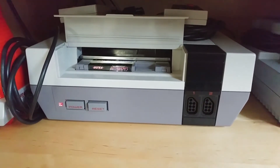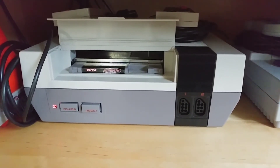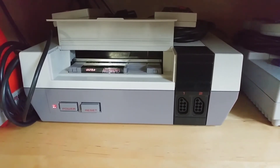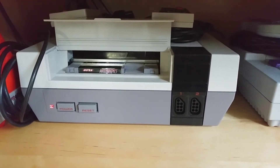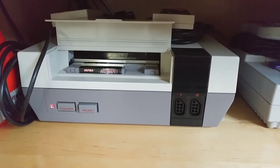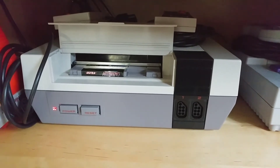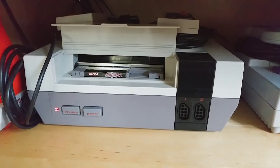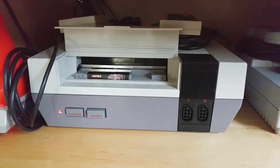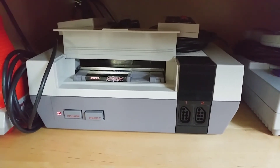The moral of this story is: clean your NES. Don't use sandpaper, don't use Windex, don't use Brasso, don't use anything not designed for electronics, and don't use anything that contains ammonia. Ammonia is corrosive, especially to soft porous metals which electronics happen to use. And since electronics have electricity going through them, it creates a phenomenon known as electrolysis, which accelerates corrosion. Don't use household cleaners to clean electronics.